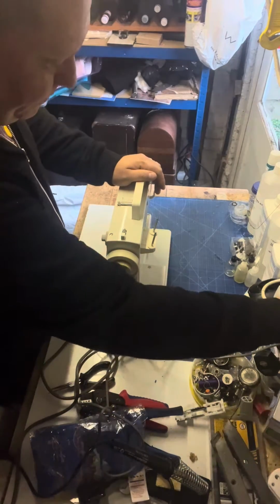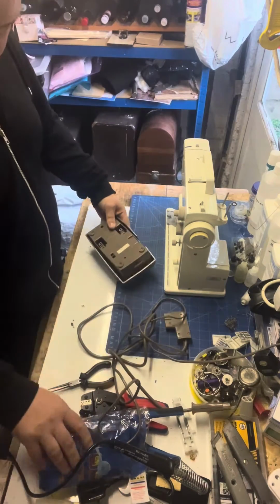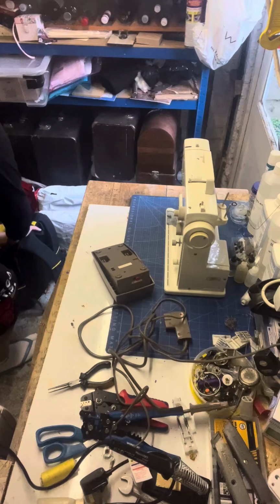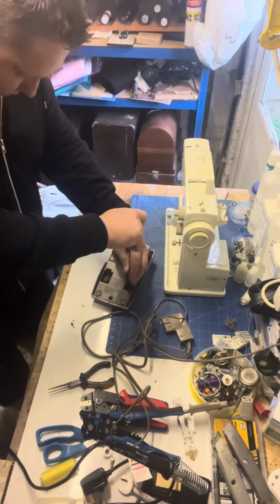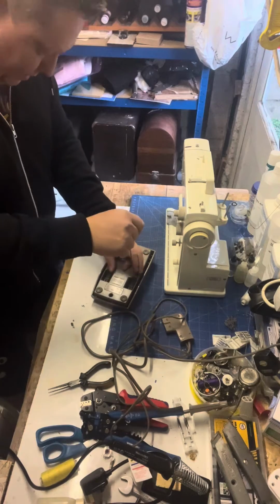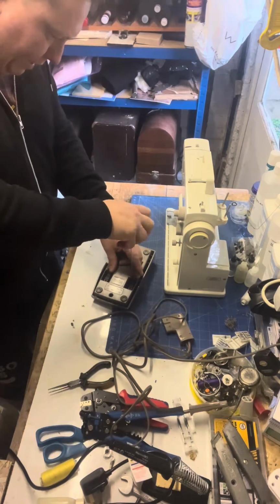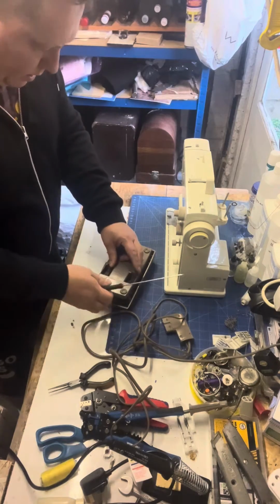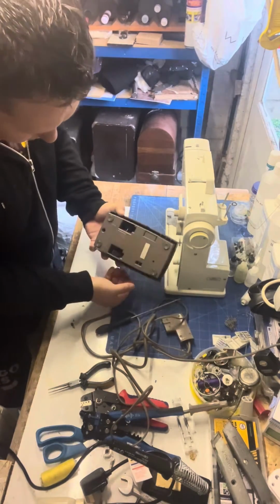So the next thing I will do is foot control repair. That's most likely going to be my first port of call. Let's see if I can find my trusty favourite screwdriver. So in we go to the foot control. When you're doing this, I find it better to undo opposite screws on the diagonals, it just means that nothing's going to fly off at you. In fact, it might not be the capacitors, although we're going to change them. It could be the carbon tracer pins not making contact, which would then also mean that the foot control wouldn't operate.